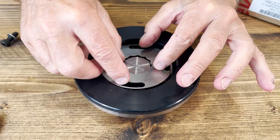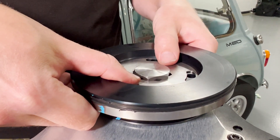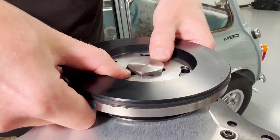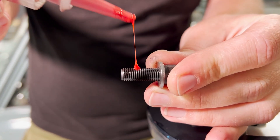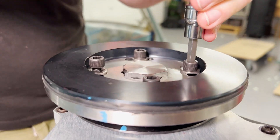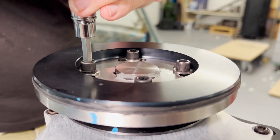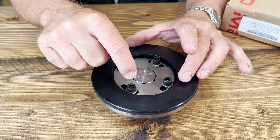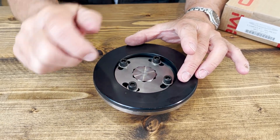And then this is the trick part — this actually locates on the hexagon of the bolt, like so. We suggest a dab of Loctite on the thread and torque them back up to 20 foot-pounds. Doing that, the bolt can never ever come loose because the plate is locking it in, and the screws should not come out because you've Loctited them in place.